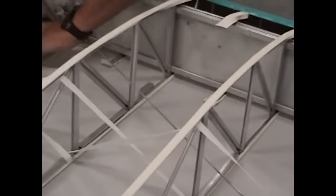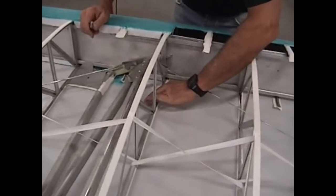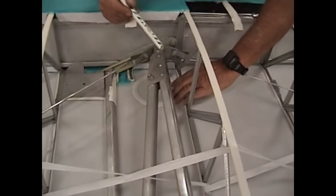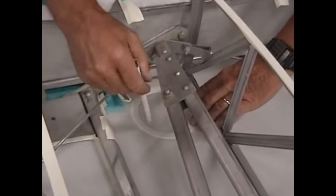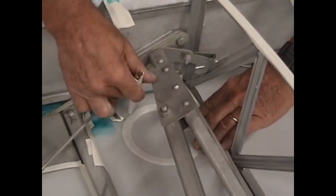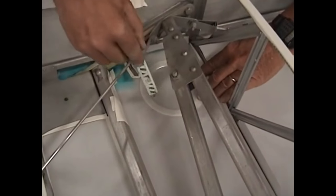We can come right down the wing to another area where two fittings come together. We can do double duty — put this ring about right here. You want to keep it off of the rib; don't glue it over the rib section. But when that's open, we can get in here to inspect these areas if necessary. So again, hold the ring in place and mark it with a pencil.